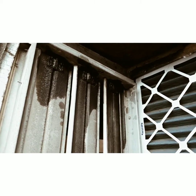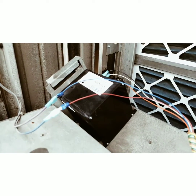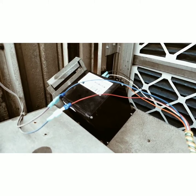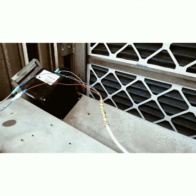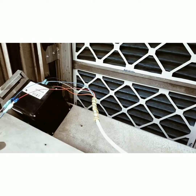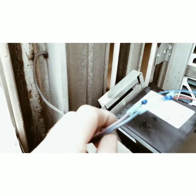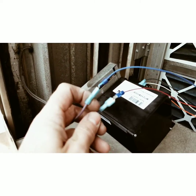So that WD-40 is setting in there, and while it settles I'll give you a quick rundown on what we've done in this section. We've run eight-conductor wire out to the actuator and out for the outdoor enthalpy sensor, through that knockout there into the fresh air hood that I showed you earlier — that's where that sensor gets connected.